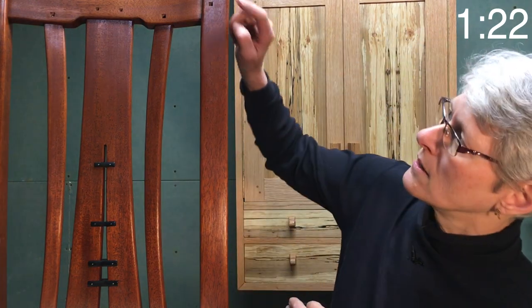These will be used to pin the tenons in anywhere where we have the quarter-inch holes around the rail and also up at the top of the crest rail. That'll make our chair much stronger and hopefully help it last a little bit longer.